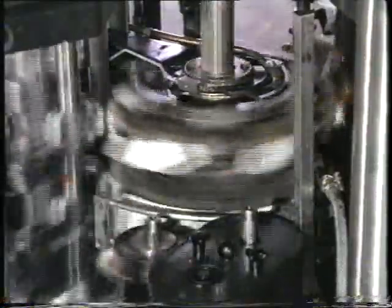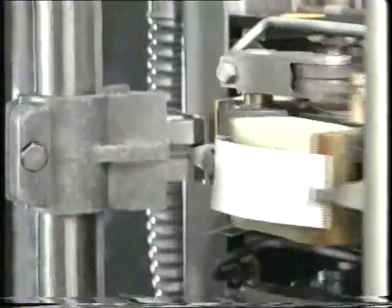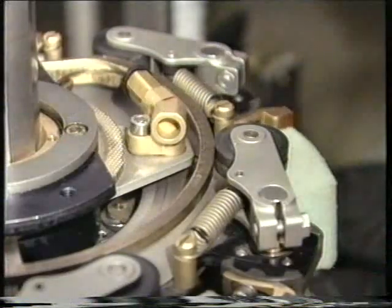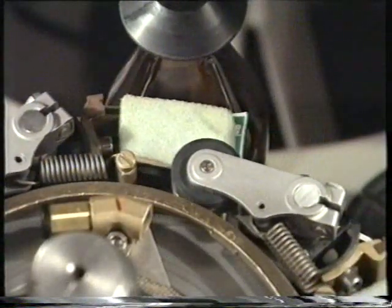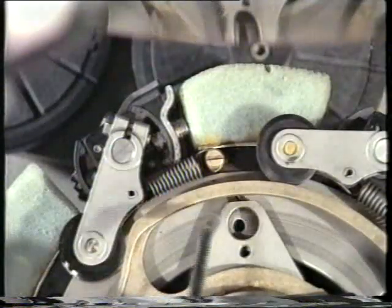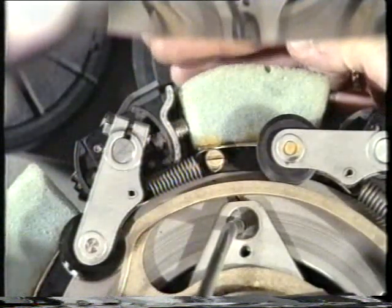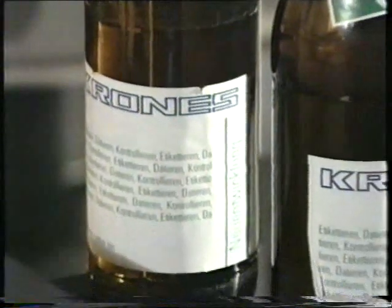In case of major deviations, the adjustment of the shoulder gripper cams must definitely be checked: the removal from the pallet, the center position of the sponge pusher, the transfer of the label onto the bottle, and the air blast — which is supposed to blow the label away from the anvil and not blow it onto the bottle.